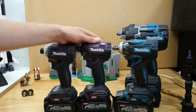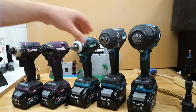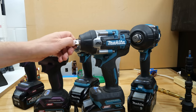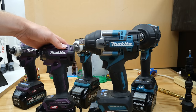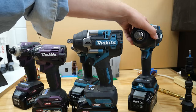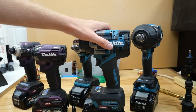Taking a quick look at battery life — three bars, three bars, three bars, four bars, and three bars. Mid-torque the only one that didn't lose a bar. If I was to only have two of these tools, I'd probably go the 002G and the TW-007G — I'd go with the 7 because it has the friction ring, which I prefer to the pin. The 002G not so good on the big ones, but nicer to use on shorter length screws — so use that for the small stuff, and for bigger stuff use the mid-torque. The high torque is just a bit too heavy for regular use. The mid-torque is not a bad weight really if you need to drive big stuff — not as quick, but as long as you're not doing millions of fasteners, should be all good.